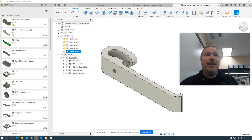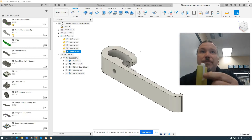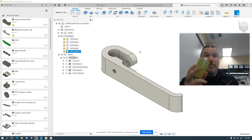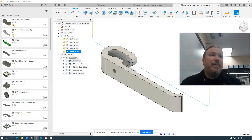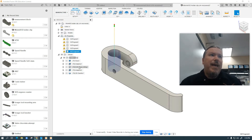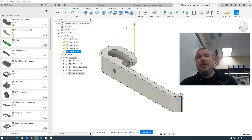What you're seeing right here is the project I'm going to be working on — this little guy here, the belt clip to an ID holder. The idea is we're going to make both parts — the casing and the clip — in a single fixture on our desktop. I've got a facing operation with a one-inch router rabbiting bit, a quarter-inch end mill for adaptive clearing and hole drilling, an eighth-inch end mill for cleanup and hogging out all my pockets to finish size, and then a chamfer for deburring. That's hold number one, and there will be three total holds on this part.